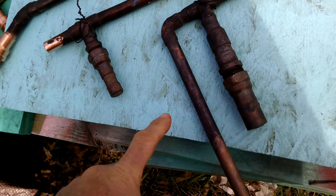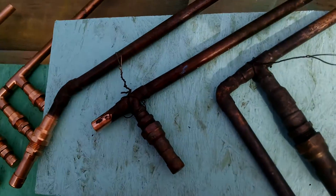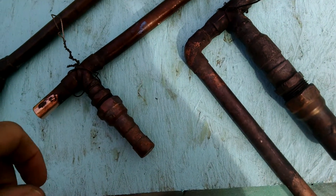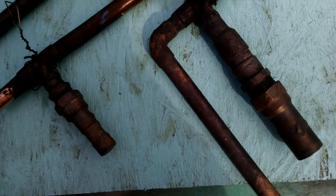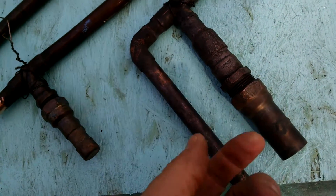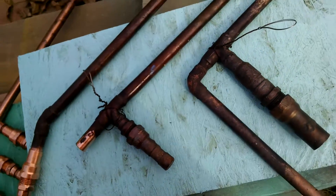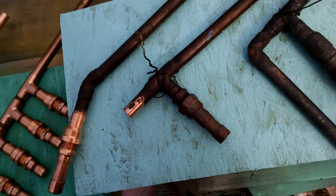It actually takes a while if you just have single burners, but having multiple ones should make it a lot quicker. One important thing: after you heat it, you've got to add water to the threads — it's totally mandatory. You can get a little squirt bottle, melt a little hole in the top, and squirt it, and that will make the threads come off easy. If you don't, it'll fuse. Also when you tighten it, do not make it tight — just tighten it all the way and back it off like an eighth of a turn. Leave a little bit of slack and it'll come off a lot easier.